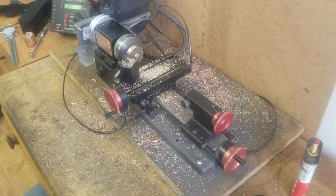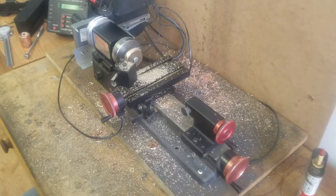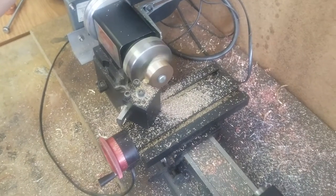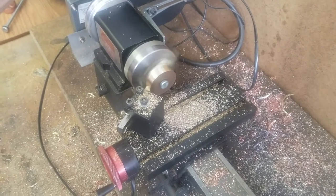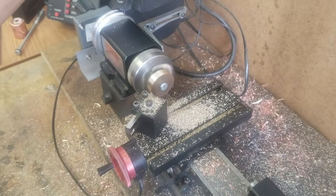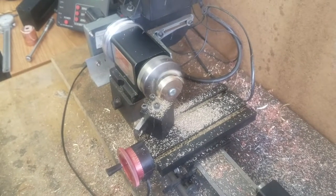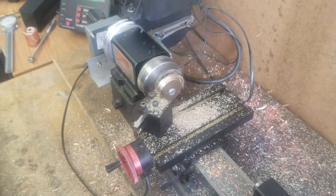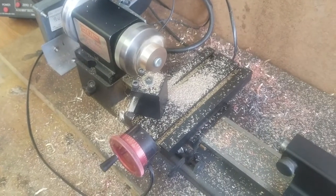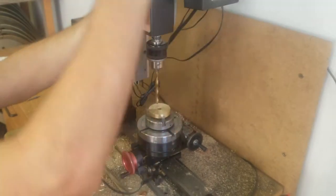Here we are mostly done creating the circle the way we want to. You can see I'm using the power feed — it's turning all by itself on the y-axis. If you want to know about power feeding this particular lathe and what we did, you can look that up in one of the other videos to see exactly how we did that if you want to make that modification yourself. All I'm doing is readjusting the feed on the x-axis and letting the y-axis power feed each time, so the machine's giving me a beautiful finish and getting this done relatively quickly.